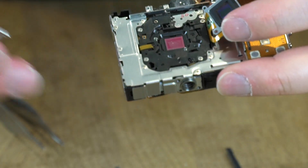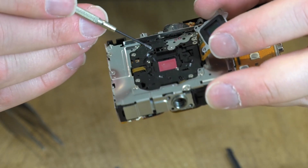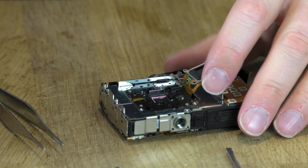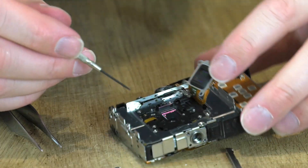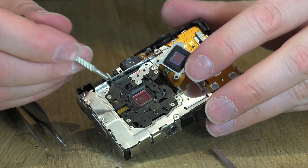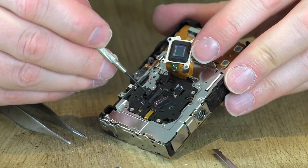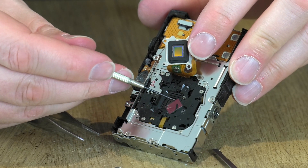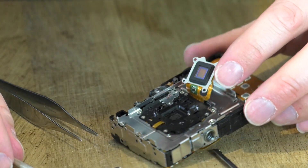This is the important bit — the infrared filter, hopefully you can see it just there. It's kind of got a reddish tinge to it. That's what's stopping infrared light from hitting the sensor. So I need to take this infrared filter out. This is fairly typical of most of these cameras — there's a little spring there. In some cameras these have a rubber bevel around the outside, but this one doesn't seem to. I think it might just pop out. I'm going to give it a little bit of persuading — and there we go, it just popped out. That is the infrared filter, just popped out of the camera.